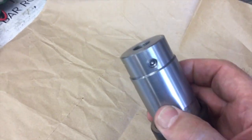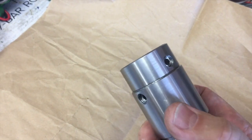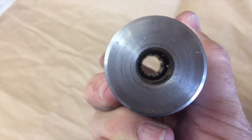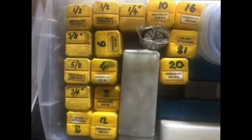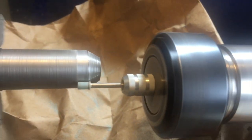The main component of this is an ER32 collet holder which I machined. I have another ER32 collet holder mounted on a Morse Taper 3 for going directly in the spindle, and this one is to be mounted directly on the shaft of the motor — no belt or gearing. The motor revs up to about 8400 RPM which I thought would be fast enough. I took the nut from the commercially made ER32 collet holder, produced a thread and a taper to place the collet inside. I have a good collection of collets, both metric and imperial, so I can mount all kinds of milling and grinding tools. This is a Dremel collet holder that goes into the big collet, which allowed me to mount small grinding tools.